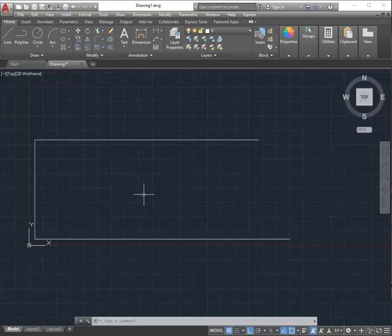That's if it's rendered on one side, but then it probably will be rendered on both sides. Oh, on the other wall. Yep. So that gives us 290, and actually render is often about 13 mil, or even sometimes a little bit thicker. So 13 mil is the standard thickness that you specify, but we can assume here maybe it's 15. That gives us 15 either side, which is 30. So 270 plus 30 gives us 300.